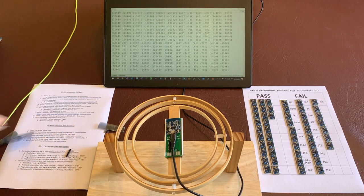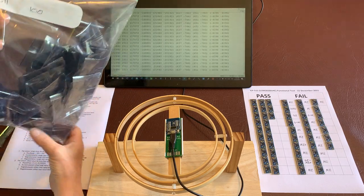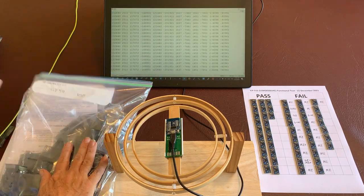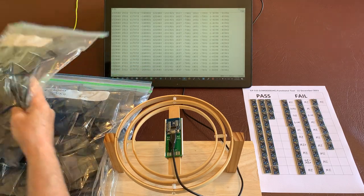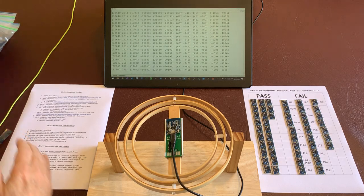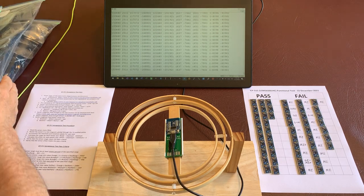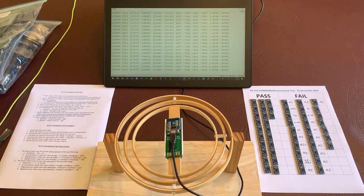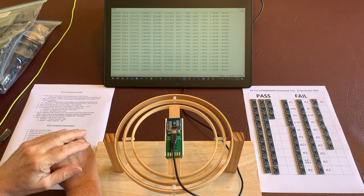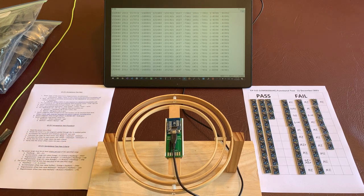All right, so that's 50 that we have tested and we've got 23 passed. That was the bag we were testing, so there are 50 more to do, then another 100, another 100, another 100 — making up a test of 400 units. But the results so far aren't looking very good, with greater than a 50% failure rate so far. I think that's all I need to show you. We'll do the rest of the testing and find out what the final result is. Thank you for watching — if you want any further details, check the YouTube information and for the reason for this project have a look on our website, sarcnet.org.